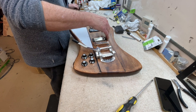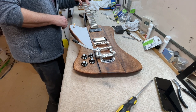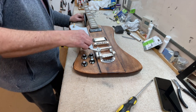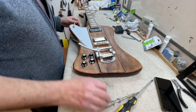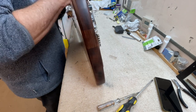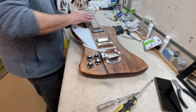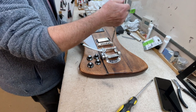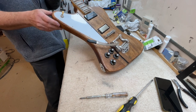This nut is actually nearly good enough as it stands — oh no, it's a little bit down at that end. That's still high. Does it actually go down any further? No, that's it. If this is just on 1.5mm I will be able to live with that. Yes it is — it's barely workable. So we don't have to shim any more than that. What we do have to do is lift this end up a bit, which goes to show how off-kilter this thing is from the get-go, which I find really upsetting.